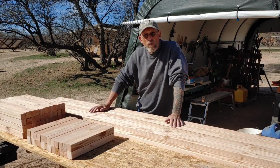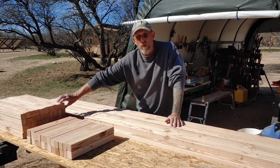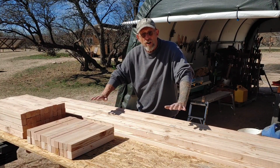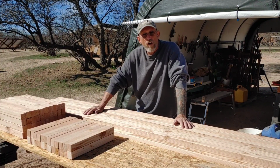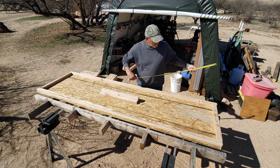What I'm going to do is build the long sides of the boxes first. And that's going to be comprised of 2 8-footers and 5 of these 22 inch pieces over here. I'll screw that together doing a layout here on the table. Make all the long sides first, and once that's complete, I'll bring in Yvonne to help me put in the 15-inch cross members that will then actually create the box.